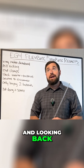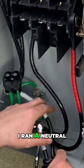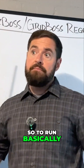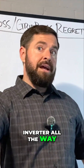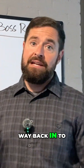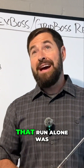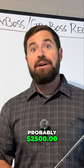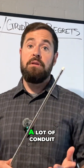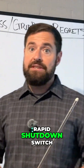And I ran a neutral out there, and looking back, it was just totally unnecessary. I ran a neutral out to my non-fuse disconnect — to run basically my output from my inverter all the way out to my disconnect by the meter, which is required by my utility, and then all the way back in to the grid boss. That run alone was probably $2,500. It was a massive amount of copper, a lot of conduit, a big disconnect, and communications cables to run out there to my rapid shutdown switch.